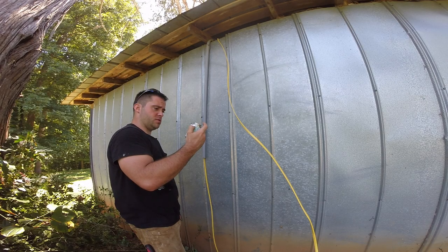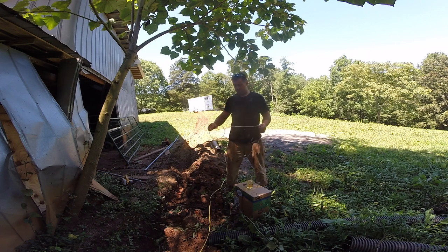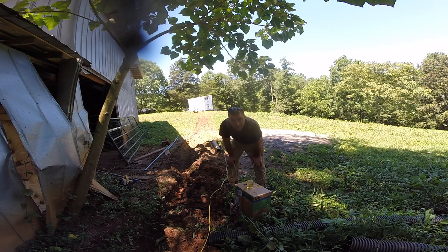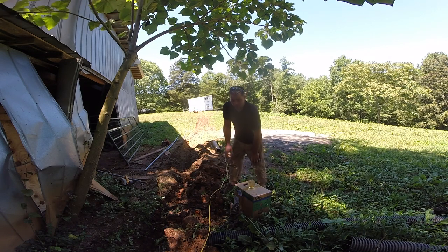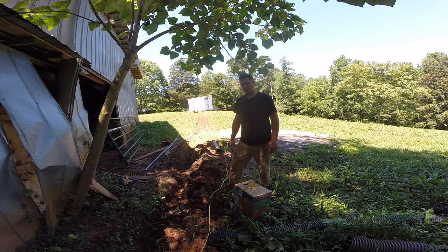Apply a light coat of cement to the inside of the fitting. So I'm going to run this wire through the conduit - that's probably not allowed. Let's pretend like I'm not even putting this in there, but I can live without cable TV. The internet kind of runs my life. I think I'm going to run the wire through all the conduit and then go back and separate them and glue them together, just in case I get too far ahead of myself. Because once you glue it, you're done.